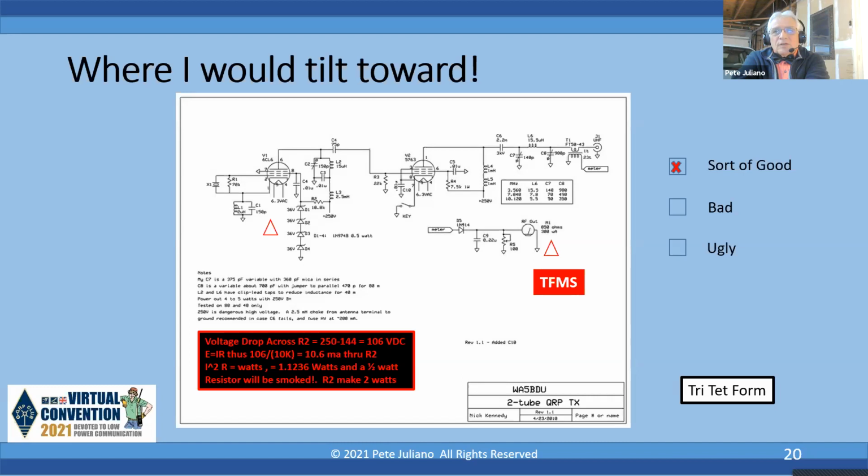C2 and L4 are in series, and they're using the common ground as a connection. So it's like the 1 ohm resistor and 100 ohm resistor in parallel. Capacitors in series are just like resistors in parallel. So essentially across the L2, you've got the 150 picofarad capacitor, because you've got 150 picofarads and 10 nanofarads.